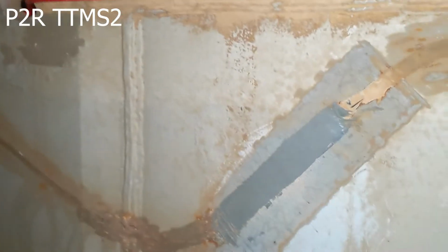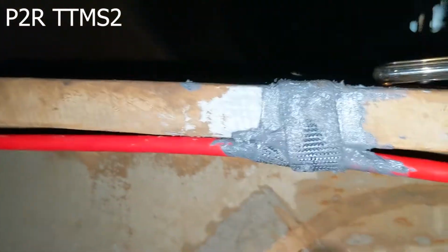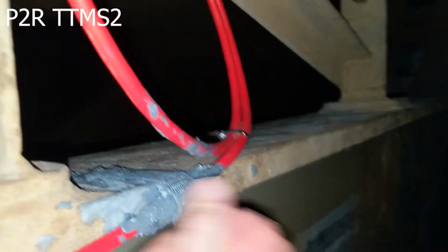Here's the tie back using the red cable that was originally tied into the temperature loop on this side of the web frame. This is the original install, and you can see the bubbling that occurred on some of the sensors. Okay, but we cut that red cable from the temperature loop, and then that came in to the other side. It's fixed here with Belzona and straps, and then on this side looped up with some zip ties up top.